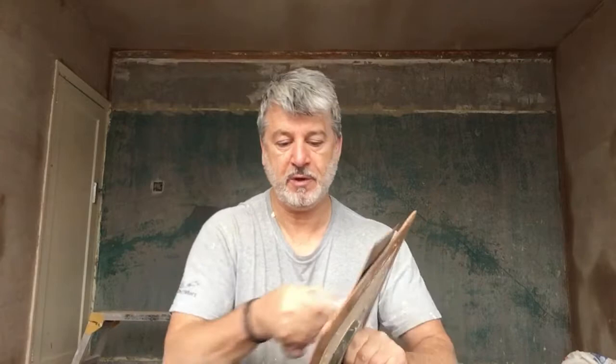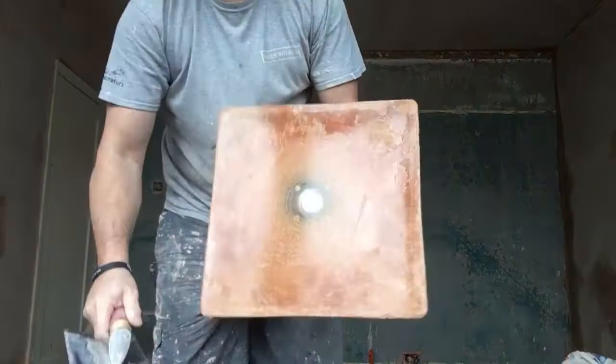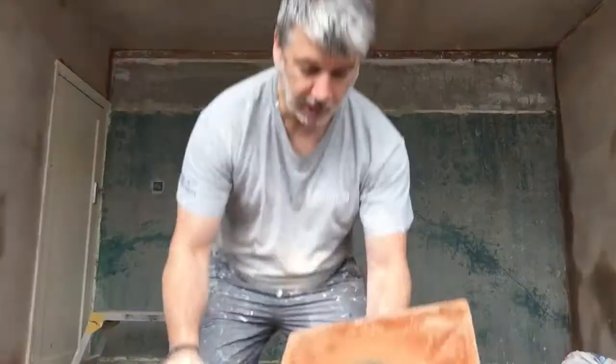What's really important is you do both the same - wet both ones down. Basically, any excess water that's on there, take it off. Let it dry for a minute, and once it's damp and wet you won't need to touch it for the rest of the day, only when you're first starting. If you put too much water on there, as soon as you apply any plaster onto that surface it will just slip straight off.